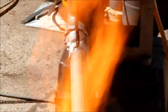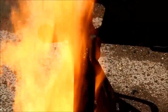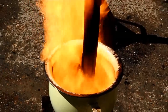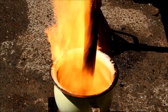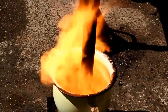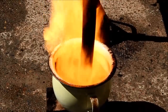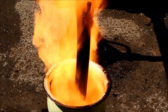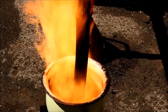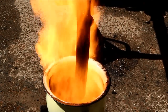Now as you can see, I've put in the oil feed that blows through the air inlet and it seems to be working quite nicely with the output. I'm noticing that there is some vaporisation of the oil in that air inlet. It seems to be aiding the combustion quite nicely because the oil is effectively half cooked off by the time it gets into the burner. So that's a good way of doing it rather than having the feed coming from anywhere else.